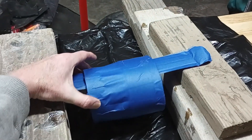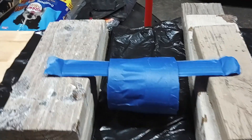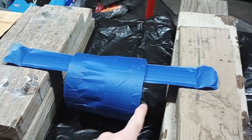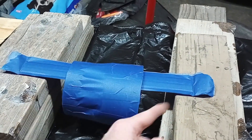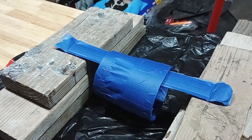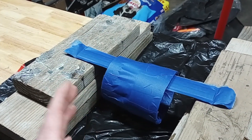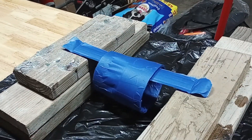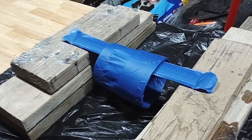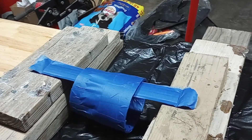So I'm going to wrap this in carbon. It doesn't matter what color because it's going to be wrapped in vinyl at the end — it's either red or blue is what I have left. I'm going to wrap that around and tuck the edges inside and use clothing pins to keep it in there. I'm going to use two layers of carbon on this: wrap it around once, fill it with resin, let it be nice and wet, then add a second layer. Let it dry out, then we'll start cutting it to shape. I'll probably have to make some recesses for the hose clamps that go on all sides, but we'll deal with that at the end.